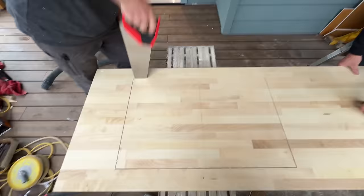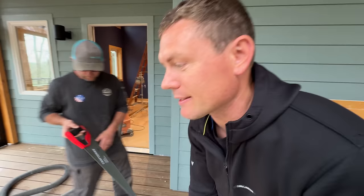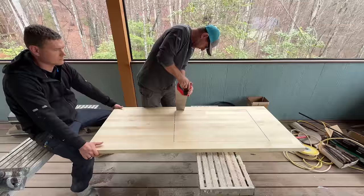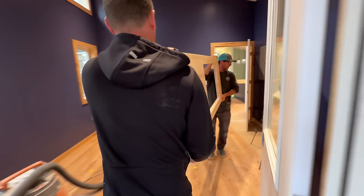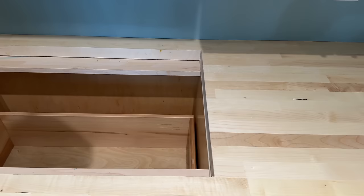He's doing it totally perfectly - I can't help myself. You think you could fit a few more pro tips on how to cut this thing out? That was everything I knew. The tip about keeping the front of the base plate aligned with the little indicator mark when you start your plunge cut - that's a great tip. I never did that until like a year ago when you said it, because your blade might be angled even if you're on the line.